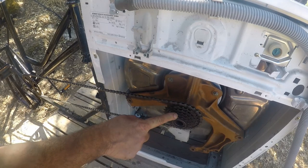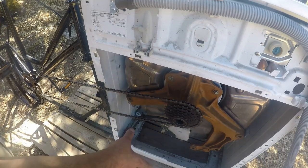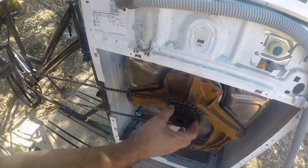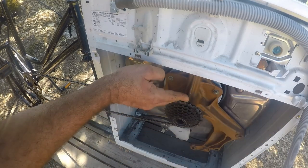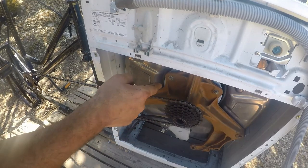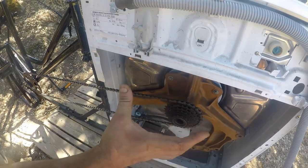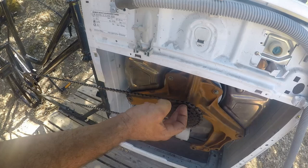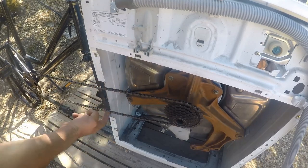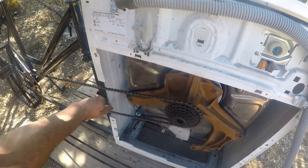If you use gears like this, I'd recommend that before you tie the bike frame and washing machine to the pallet, you put the chain on the second or third before last gear — so if it stretches or things bend, you can just bring it up and tighten it. When I had the washing machine full of clothes and water it started pulling and bending, so I flipped it up to the first gear which is easier and now it's nice and taut. I also cut out the side just because it was rubbing against the washing machine — now it's not touching and that's pretty good.